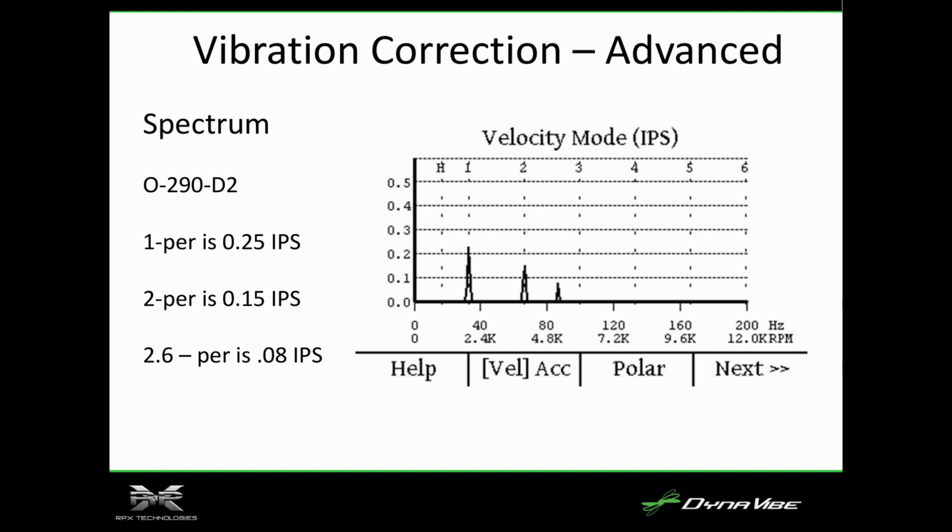It has another vibration at 2.15. So the prop is really what we want to look at. The 2 per on the long easy is actually because it's a two-bladed prop with a two-bladed wing, you could say. There's a wing in front of the propeller, and every time the propeller passes behind that wing, I get a thump thump. So there's 2 pulses per rotation.